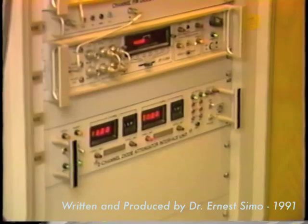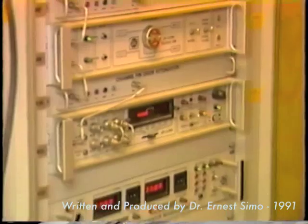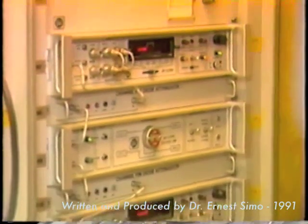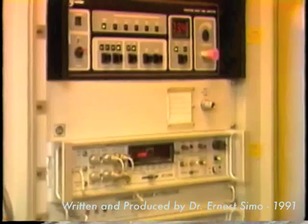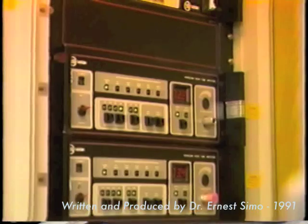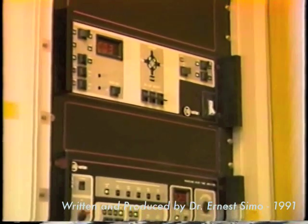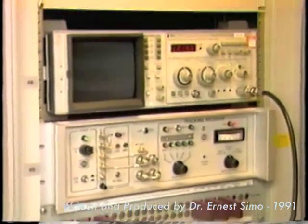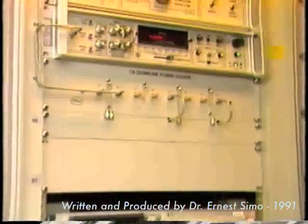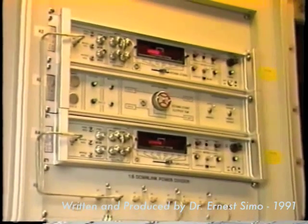The IF and RF subsystem is generally located outdoors in a radio equipment shelter and consists of redundant high-power amplifiers with 25 to 500 watts of output power depending on applications, up-and-down converters, IF combiners, and dividers. The redundant LNA is mounted directly to the receive feed in the antenna hub in order to reduce waveguide loss in the receive chain and enhance the receive signal quality.